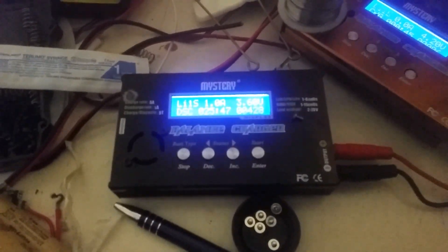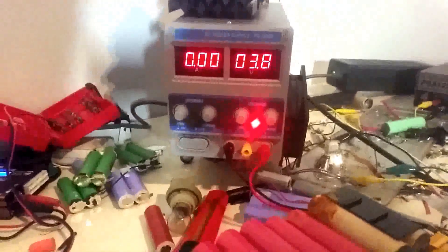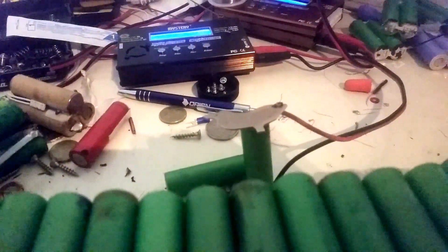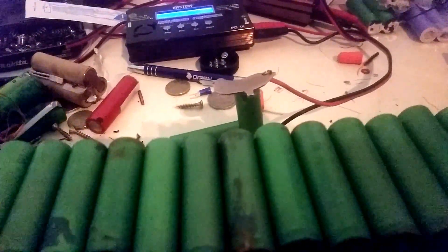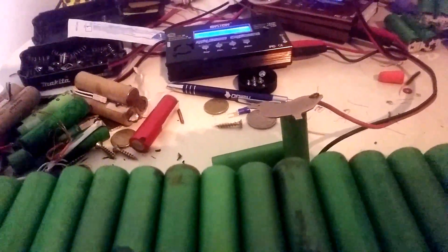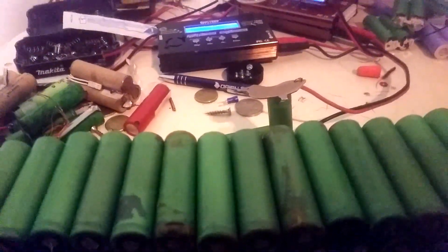All the good ones that hold voltage will get charged off the lab power supply first, then they'll get discharged and their milliamp hours will be written on them. They'll be discharged from 4.2V — or wherever they stopped self-discharging — down to 3 volts, which is considered empty for a lithium-ion battery.